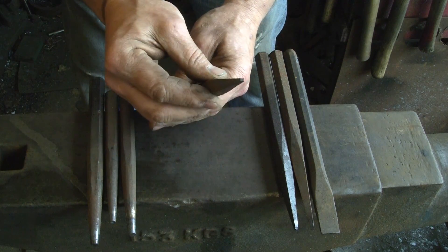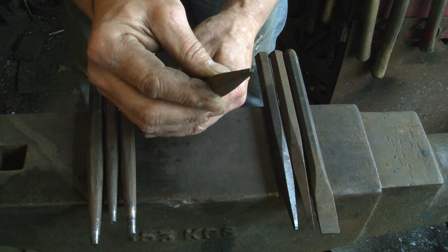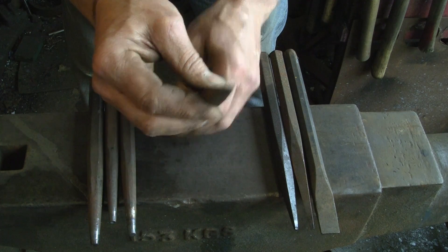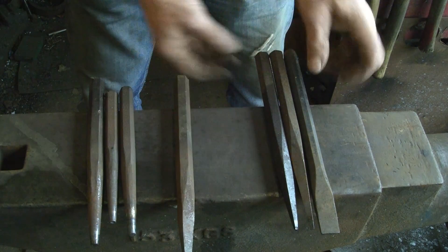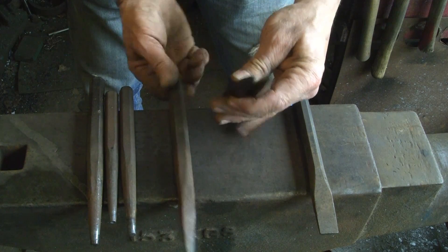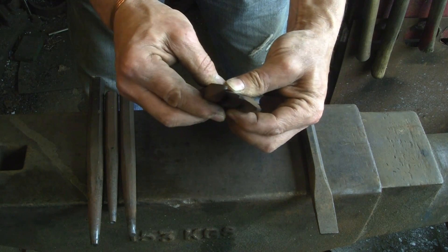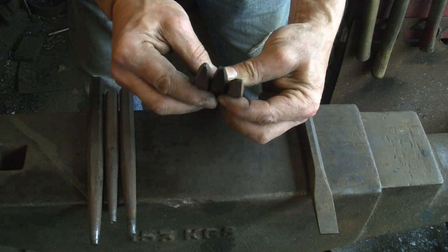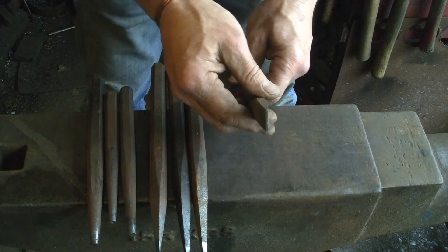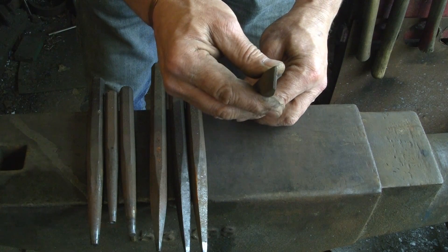In the shoes - you can see there, zoom in - very small rectangular punches. Again, three slightly different sizes for different size nails in different size shoes. The way I get them accurate is to cut the head off a nail and just use the shank of the nail to model it on. And then this one, which is sort of a slotting punch, is basically just an old chisel with the end ground off.